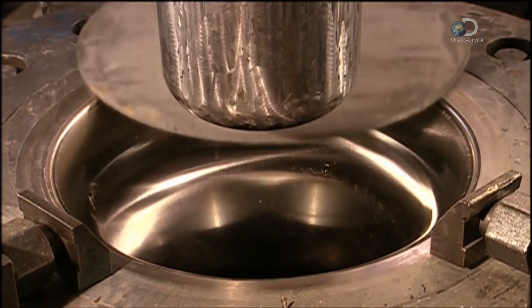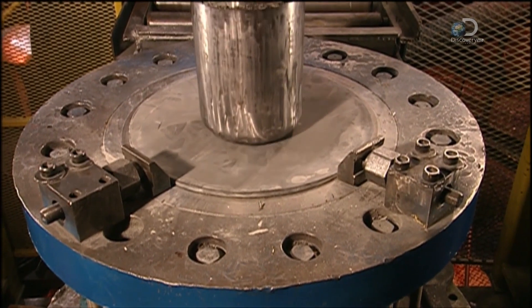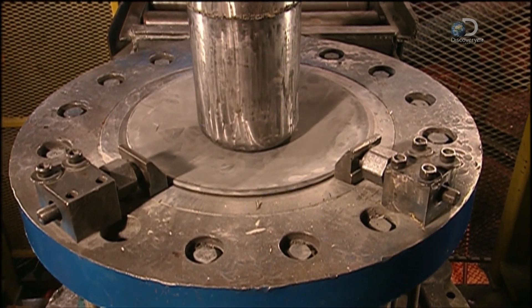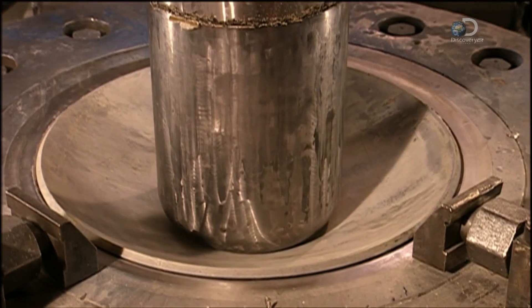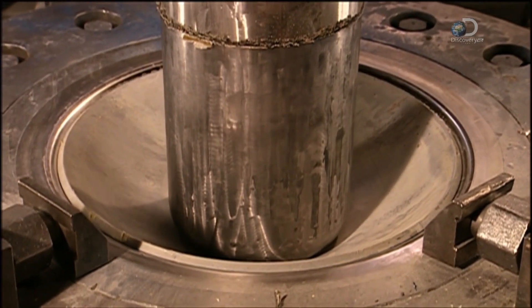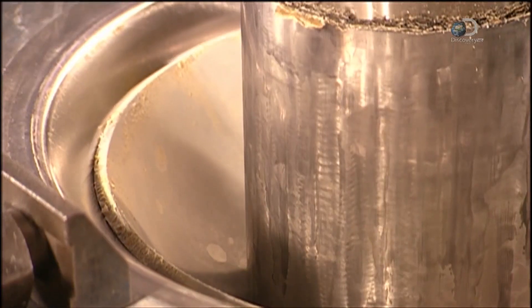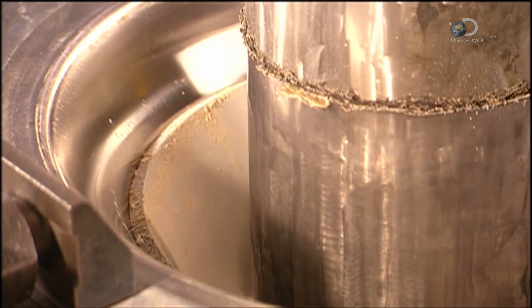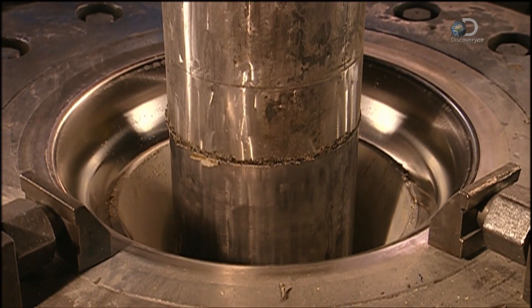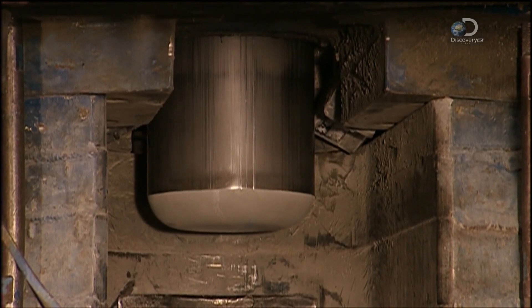After a quick drying period, each disc moves over a die. This process is known as deep drawing because a series of machines will gradually draw out the disc to the shape of a cylinder. A mandrel press begins stretching the metal, applying up to 800 tons of force — the weight of two fully loaded jumbo jets. Shaping the cylinder from just one piece of metal means it will be seamless, and that is a key safety feature.